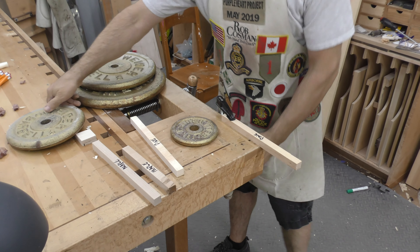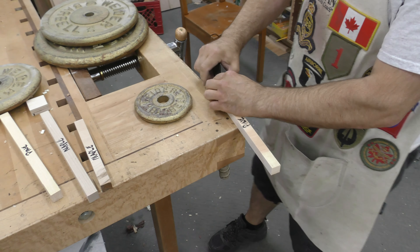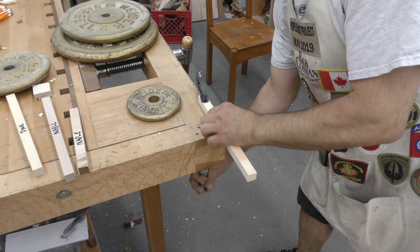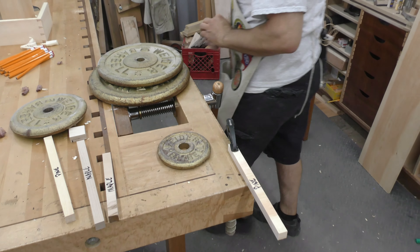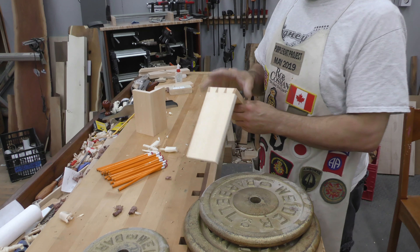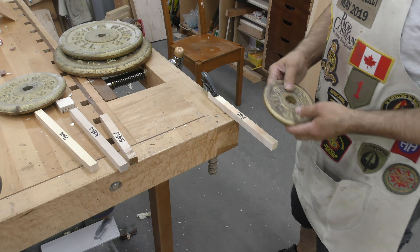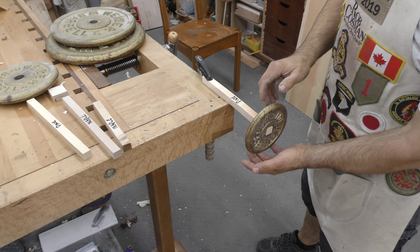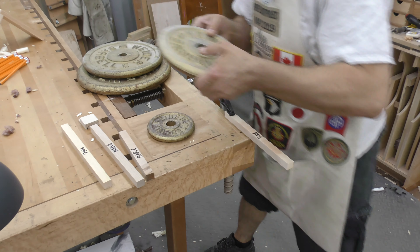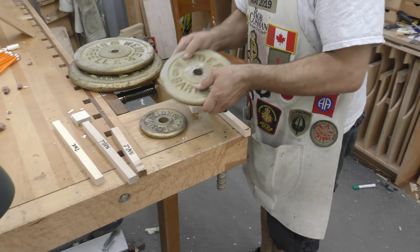Here's a piece of pine across its width. We'll do the same thing — we'll leave half of it sticking out over the edge. One of the reasons why I'm wanting to explain this is because I frequently see people cutting dovetails across on the edge of the board, which is not only unnecessary but actually makes for a very weak joint. So here's the piece of pine across its width. It will support that 1.5 kg, but I can tell by the way it flexed I do not think it's going to support the 5 kg. No — it quite easily broke.